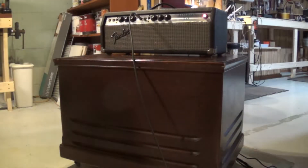Here it is, my mini Leslie. This was originally a Leslie 125. As you may know, the 125s had no upper rotor, so it was basically a big empty box inside. I decreased the size of it. I took out the standard small 20-watt-ish tube amplifier and I'm powering it with a 50-watt amp. I changed the speed switching system so it takes a quarter-inch foot switch, quarter-inch speaker in — no more six pins. And it's a pretty little handy Leslie.